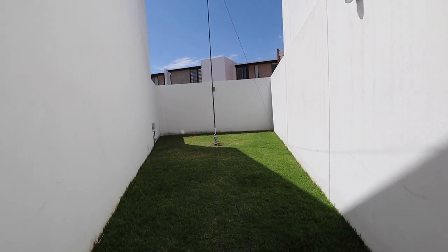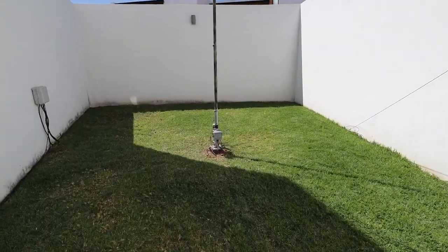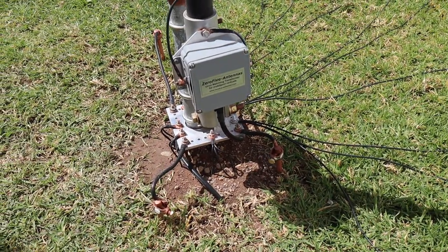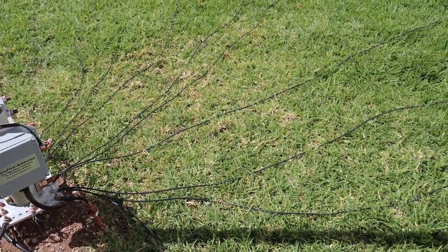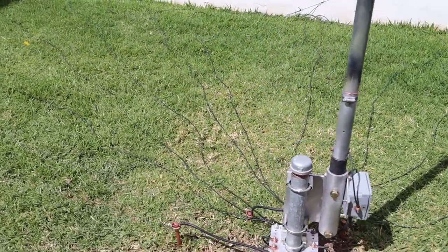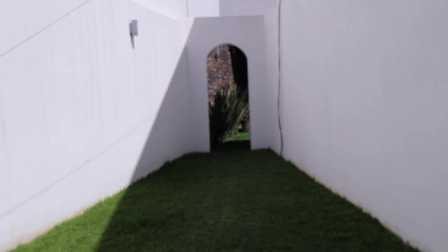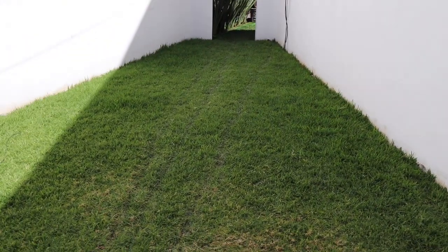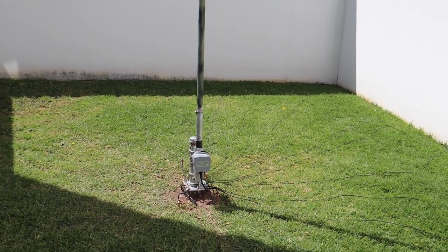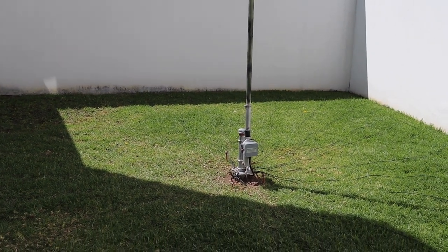This is my little garden, and I only have one thing planted — it's a 27-foot antenna. It's sprouting roots; there's going to be a total of 23 roots, in other words grounding radials. Three of them are 43 feet long and go past that arch — those three. The remainder are 27 feet long, previously used on my DX Commander. Total of 23.